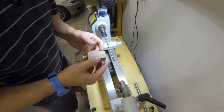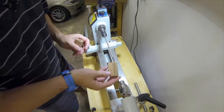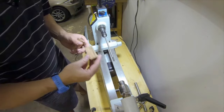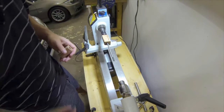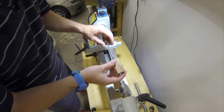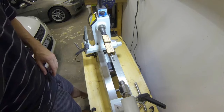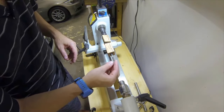Alright. So remember the indications as to which way we're going to be turning it. I'm going to be using the standard 7mm bushings on that. Pop that on there, bushing between the two. And then with the grain facing the right way, we'll pop that other end on. For this side, I normally just add a couple of bushings just to space things out.